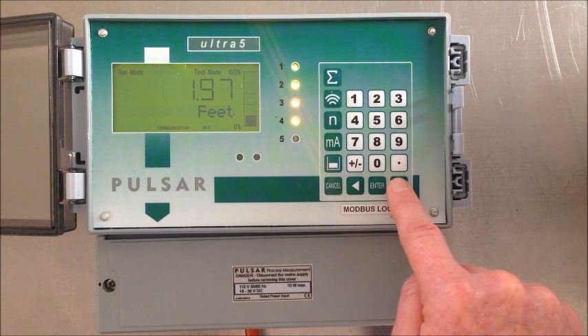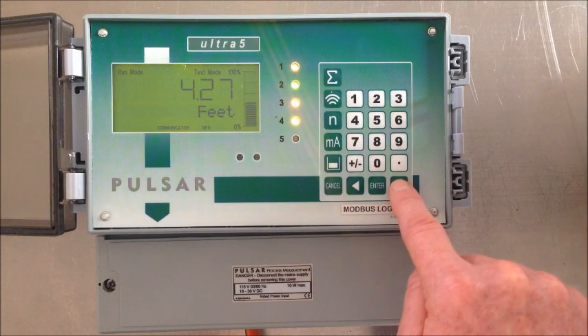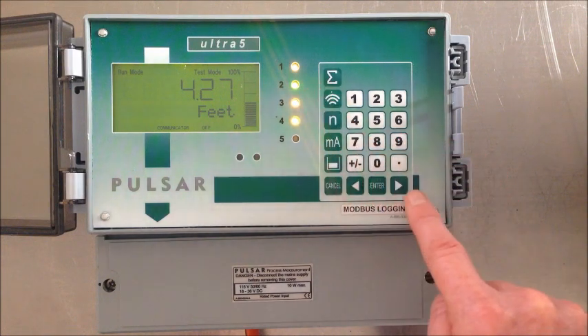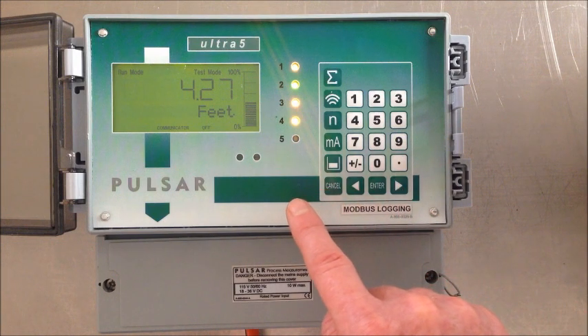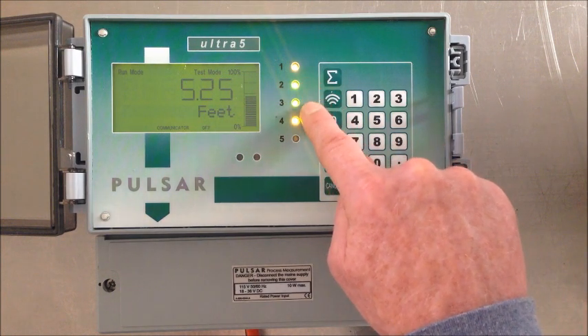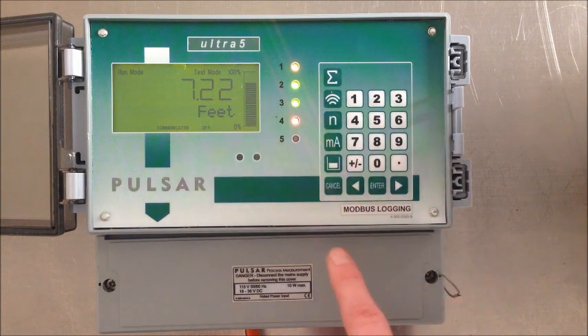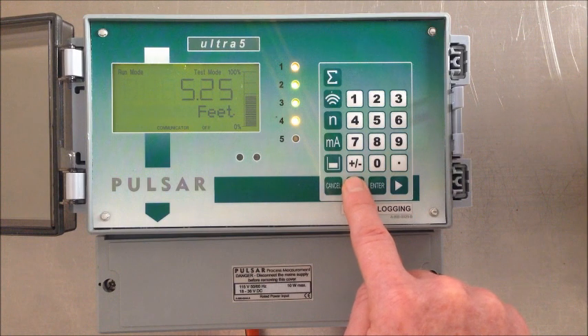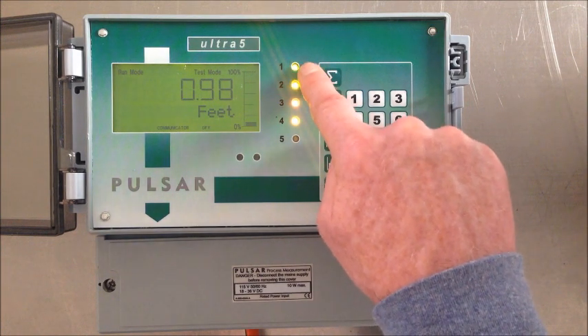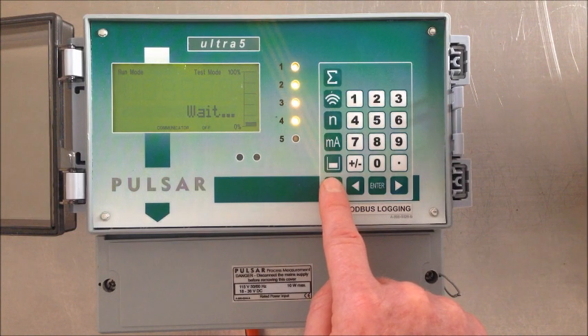So let's take this level up. We've now lost that first relay, so they're all de-energized. At four feet, pump one has come on. Now let's say we're in an application where the level is continuing to rise — we've now got pump one, lead, and the lag pump on. And that level continues to rise — we've now got that red indicating a high alarm. If we take it all the way back down, you'll see that relay one, which is the common off point for both pumps, has now come up. And that's the whole pump controller programmed.